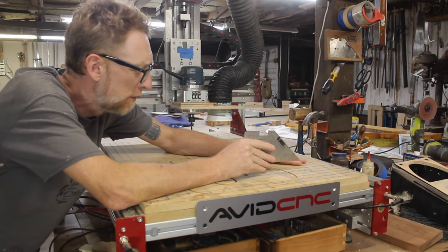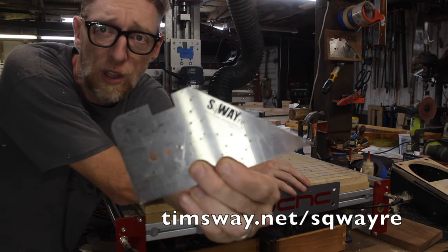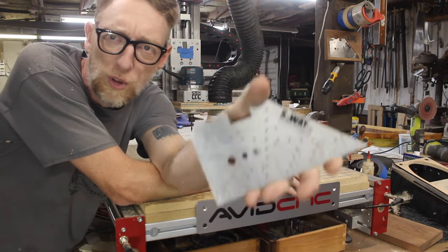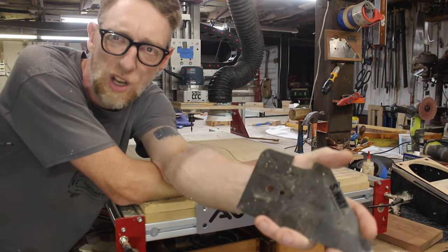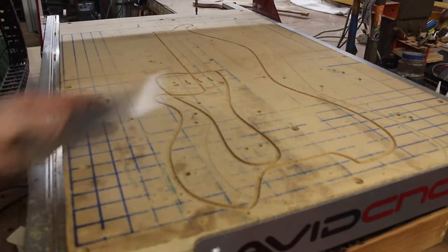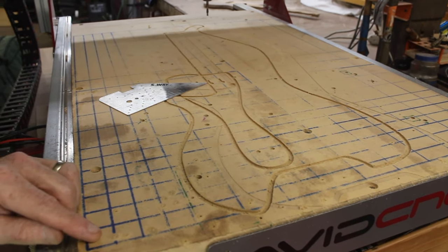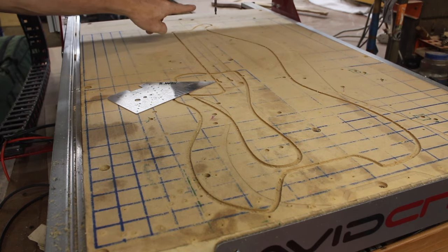My waste board's a little shot and I need to resurface it, but for now I'm just scraping it down with a tool I invented called the Square — designed it in Vectric, but had someone with a laser cutter cut it for me. Vectric software is not just for running your CNC, it's also pretty useful just for designing in general. When I level my waste board, I put a Sharpie into the chuck of the CNC and have a file where I draw lines to help me visually line up where I'm putting things on the waste board, because these lines are definitely in sync with the CNC router.